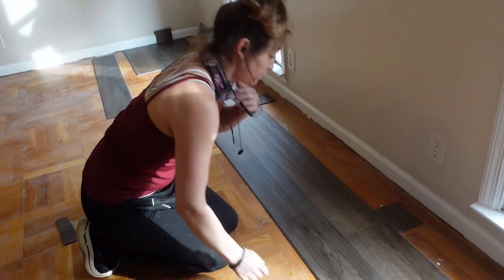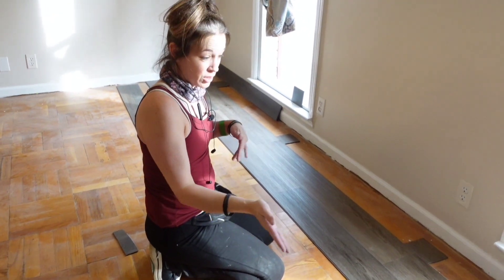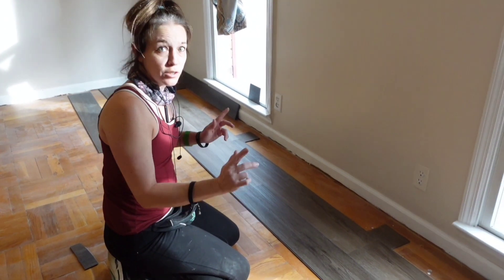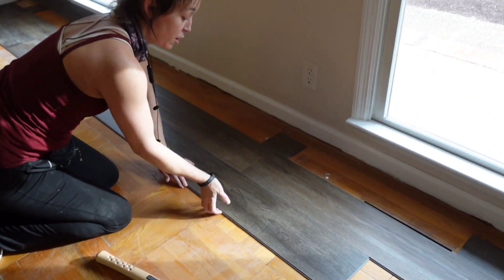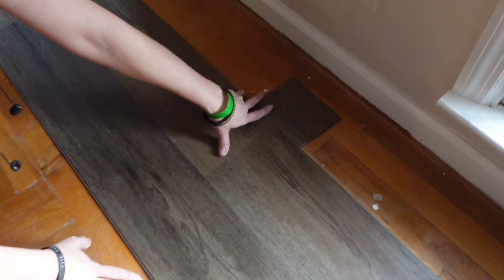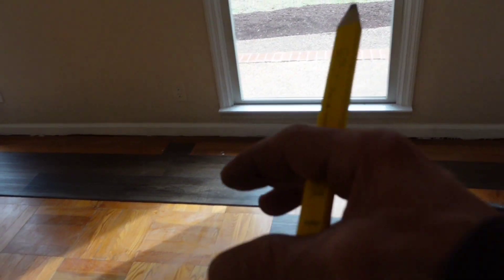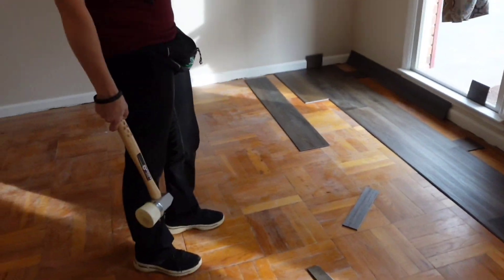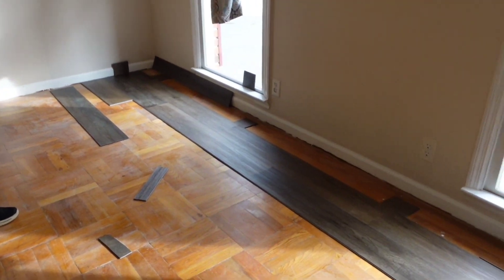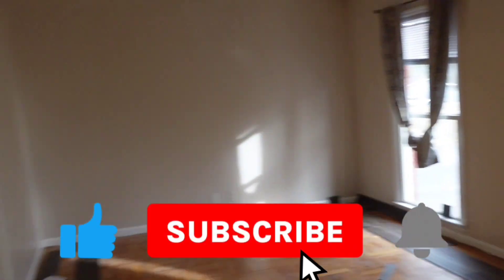Something I forgot to mention: even though I'm going wall to wall, putting the first two rows together they're still going to knock the seams out of the back. So you need to put your seams together with something so when you're knocking a board in, it doesn't knock the others out. Kelly makes a good point — you understand what she's saying? You ever dealt with that first row and how annoying it can be because it'll split your seams apart? She's locking the seams together back there so that doesn't happen, and she can floor all the way up to the door.